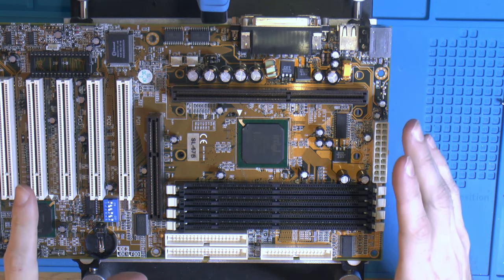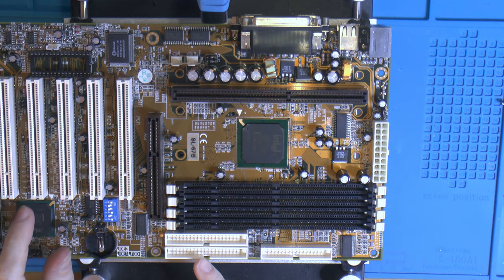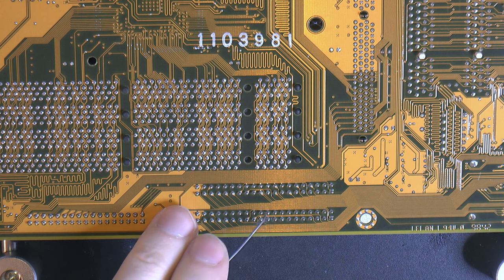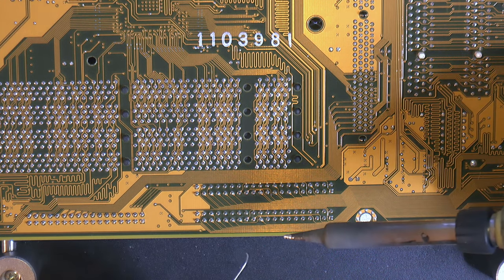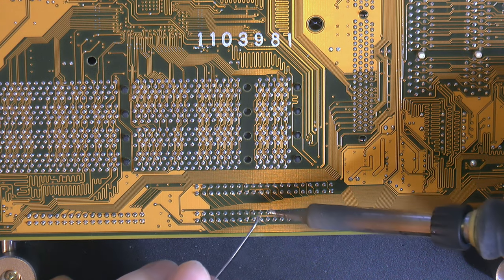The motherboard is on the hot plate, so we can get started. I'm actually gonna do the IDE first so I don't forget. We're gonna pull out the pins here for the keying, so that will actually work. It's pin 20. Now I have no idea how hard these are stuck in the plastic, and that could be a little bit annoying. Removing pin 20, which is the second row from the outside. This one, and should be that one. So I'll see if I can push them down with the iron so I can grab them on the other side with some pliers or something.